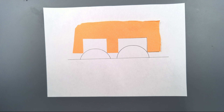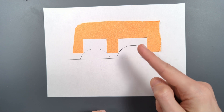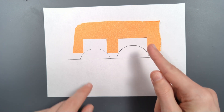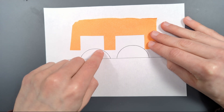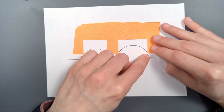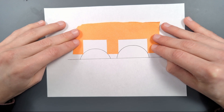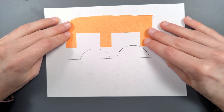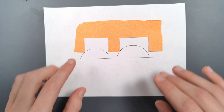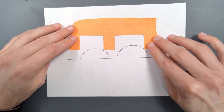A really important thing to recognize is that this only matters for a very brief period of time. The blade has to travel up the second ball as well, and this one is at a higher slope — the curve is angled more upward. As the blade travels up that side, pretty quickly we stop making contact with the second ball entirely. So even if you arrange the second hole so it is making contact, technically it makes the detent weaker, and only for a very brief portion of travel. It's a pretty small impact overall.